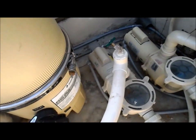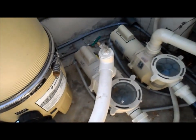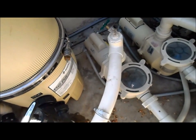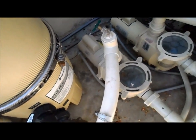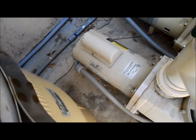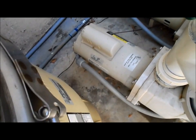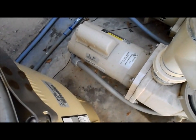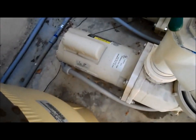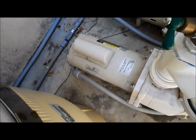I recommend you stick to the four major brands if you put a pump in: Sta-Rite, Pentair — this here is a Pentair Whisper Flow Pump — and there's also Jandy and Hayward. Those are the four main brands of pumps. When you replace the motor, try not to get an off-brand motor. A.O. Smith makes a really good motor that works on almost all of those brands I mentioned. Replace it with the manufacturer motor — this is a Pentair Whisper Flow Pump, so you use a Pentair motor or an A.O. Smith motor.